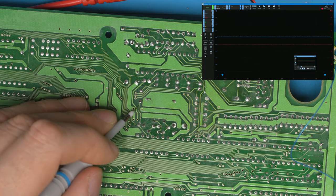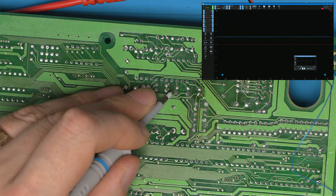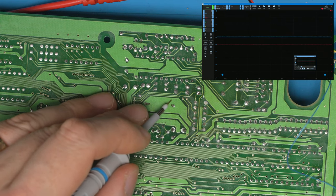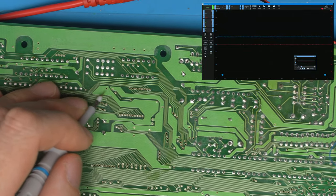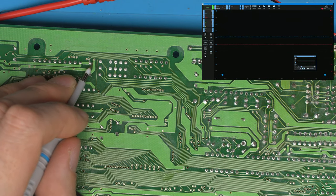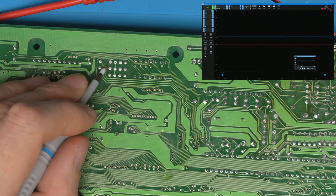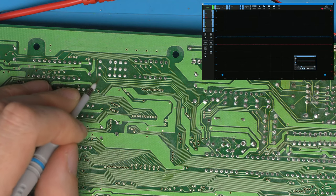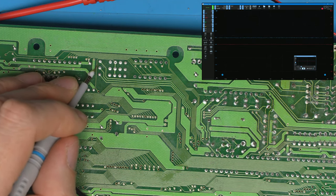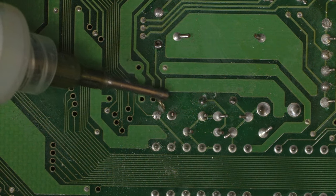We're not going to use these three traces anymore. And what we want to do is probably lift these three caps up and send the outputs instead of through here, through to the destination. So it goes through here, over, up, across to these three vias. And by the time we're here, hopefully, this isn't a clock. Nope. So there's no noise there. This isn't. This isn't. Well, we'll cut these three traces so it doesn't matter, or see where they go. But it looks like we can join up over here. So let's figure out a plan. And we'll start by just reinstating this trace here.